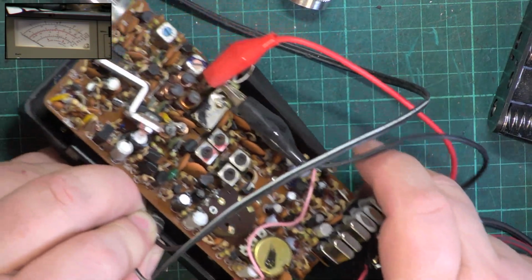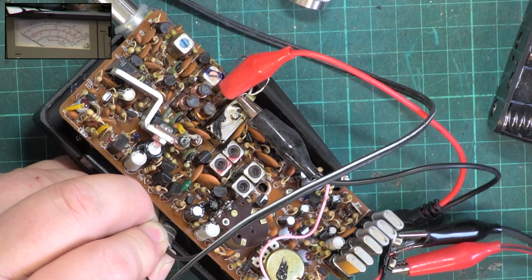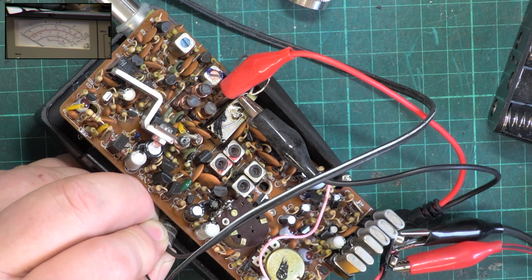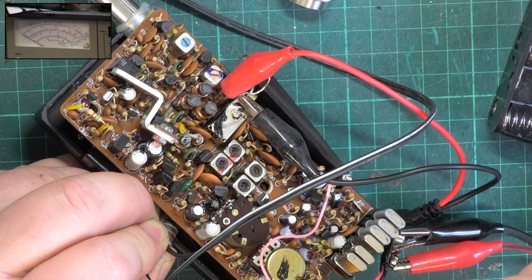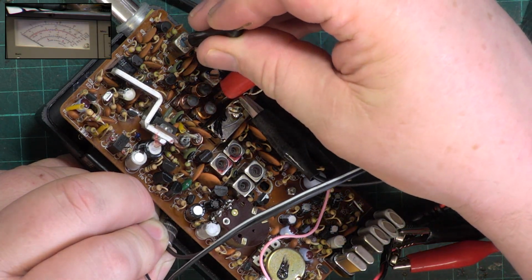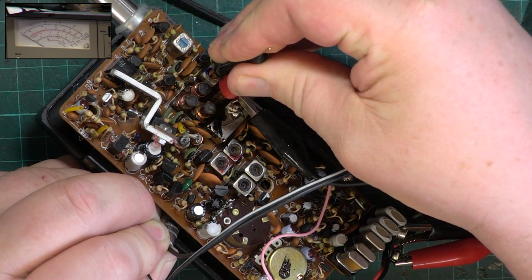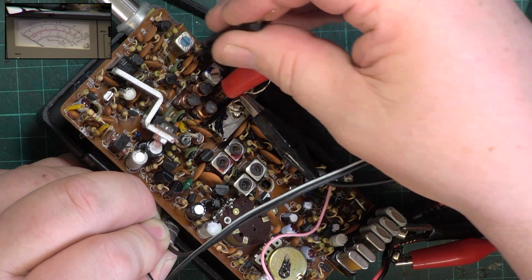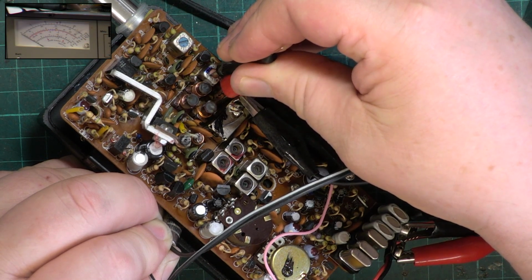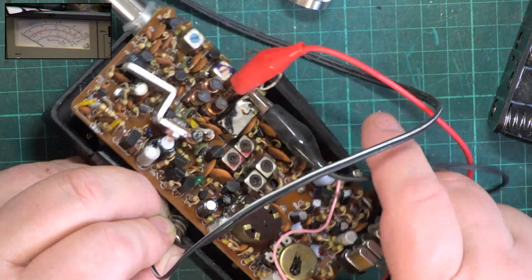Hopefully we can see what we're getting. So we'll get the Sinad meter to there. So just to tell you, at the moment for 12 decibels Sinad, it's doing 1.2 microvolts. Probably about where it should be. No improvement. Very slight improvement. So now we'll take that reading again. Oh, blow me, my thing's fallen off.